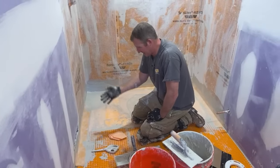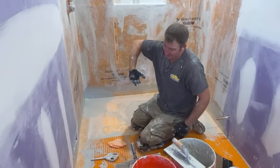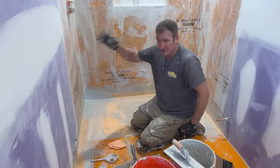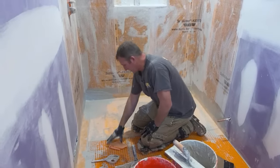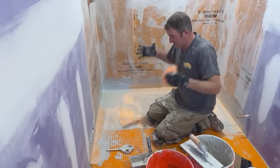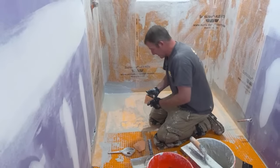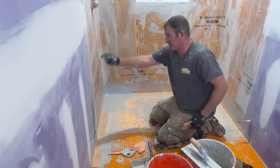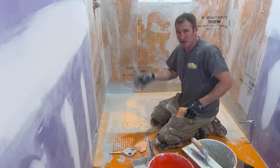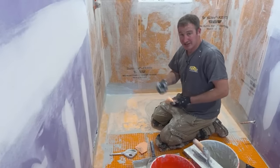You really want to just have a door, a shower, and this is gonna be a sliding one too, because I don't have the room for the opening. I mean, you do have the room for the opening, but the client wanted a slider. So you just have to be careful when you're doing a curbless shower. You want to make sure that your shower doors are going to make sure that the water stays within that space. A lot of the ones that have it, you know, they're frameless, but they at least have a U-channel that comes down along the floor, and that'll be a better seal than just doing the ones with the glass clamps. So.